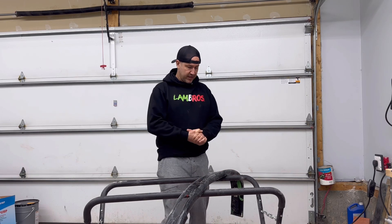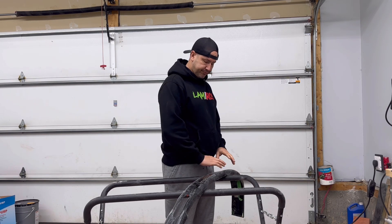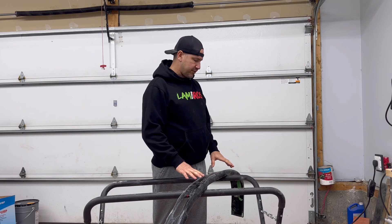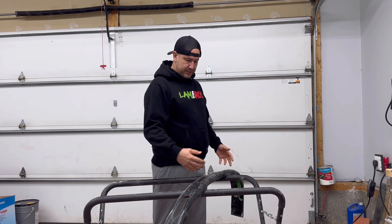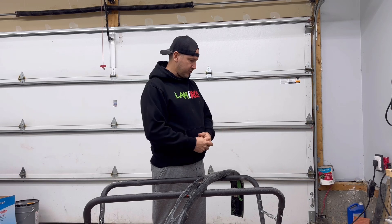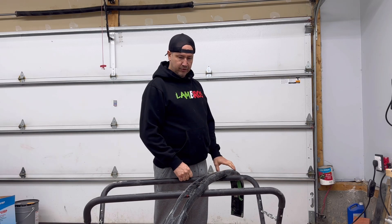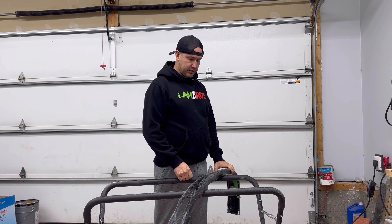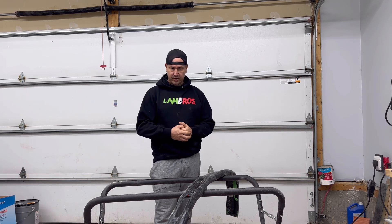Alright guys, thanks for watching. That's how you don't make a carbon fiber mold — don't make the mistakes I did. The prep was good: sanded to 1000 grit, not polished, just so there's not too much bite. I hit it with some PVA, had some mold release agent on there, and wax, and it did pop out relatively easy in some spots. A couple of areas were a little tricky around these little cooling pieces we put on, but overall it did come out relatively easy. Anyway, thanks for watching — keep tuned, there's going to be more to come, and I apparently have a bunch of work ahead of me.